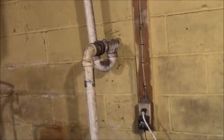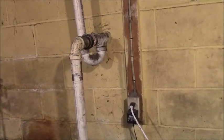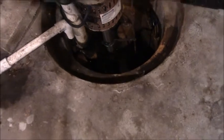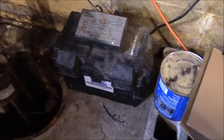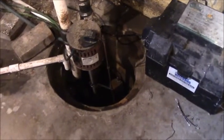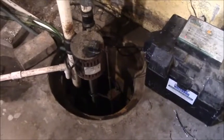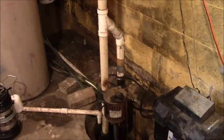So I'm going to pull this out. I've done this many times over the years; I've been in this house 35 years. What I need to do is undo this fernco where it goes outside and underground out to a swale — a deep drainage ditch on the side of the yard. This should just screw into the fitting at the bottom of the pump down there. I've got two check valves because I have a basement watchdog battery backup pump.